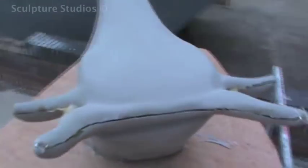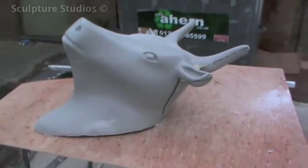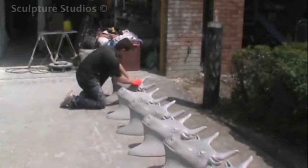The sections are joined together on the inside using glass fiber and resin — the same material as the casts themselves — and we use fillers to make good all the seam lines on the exterior. We refill and go over these, sand them down several times, and often give them all a spray so we can see the outcome of what we've just done.